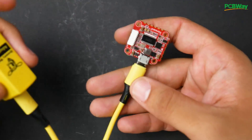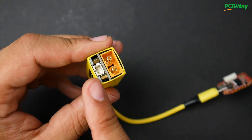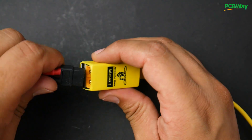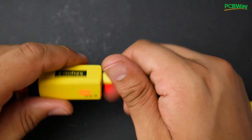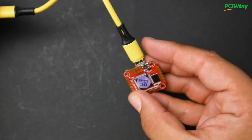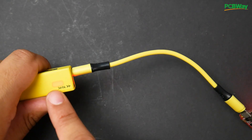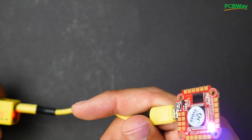We're going to plug it in — obviously we're not going to get any power from the 2FC port. For input voltage you can use an XT60 1-6S, and you also have a connector for a 1S input for your micros. For this video we're putting in a 4S battery. Once plugged in we do have power. If you install it to the FC section you don't get any power, so don't get scared that it's not working — that's what happened to me in the beginning. So if the battery is connected to your quadcopter, use the 2FC port; if nothing is connected, use the bottom port.